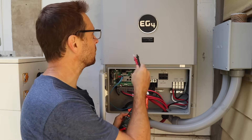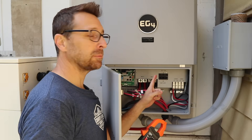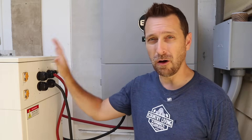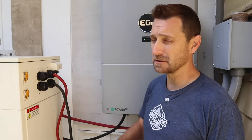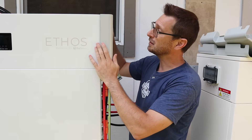Our Ethos system is up and running. Coming in we've got 52.7 volts. Our battery breaker is still off — we're going to kick that on and power up our Flex Boss. I want to remind everybody that lithium iron phosphate batteries from shipping and warehousing are sitting at about 50% state of charge. You do not want to connect all of your batteries together at the same time if they are out of balance. My Pites and EG4 batteries are at 100%, so we want to charge our Ethos up to 100% before adding all batteries together. As soon as we turn on the PV disconnect on the Flex Boss, we're going to start charging our Big Battery Ethos.